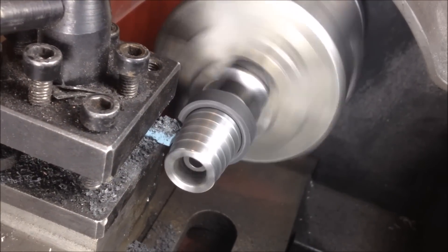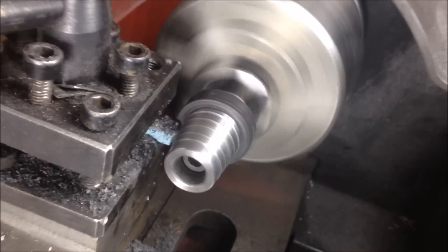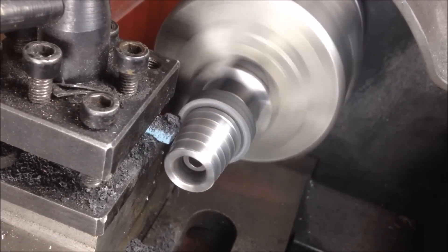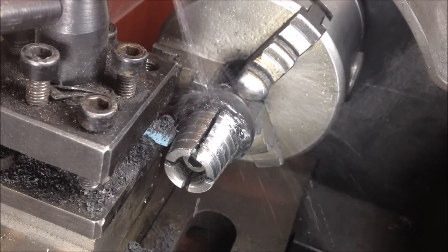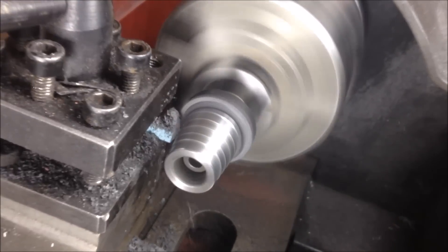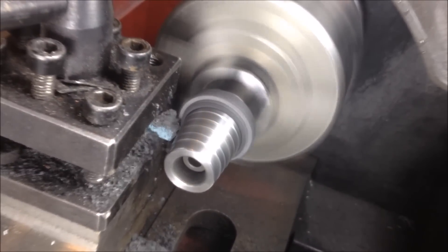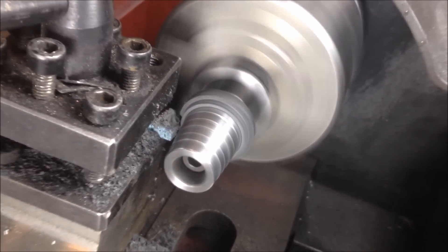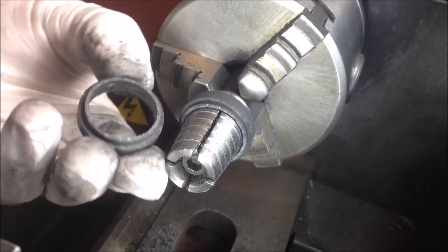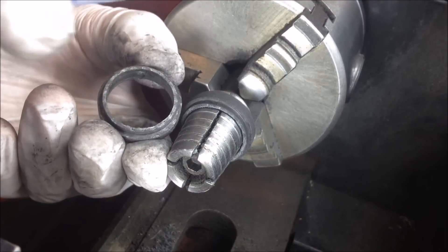We're just putting it up on the lathe — that's an expanding ring mandrel that I have it on, I'll have a link to that in the description as well. We're just shaping it; this is one half, we'll do two of these and glue them together, and that'll give us the channel that we can inlay the glow powder and malachite into. There's the shape of both of them, we got them both done.